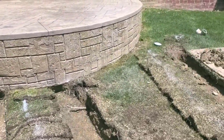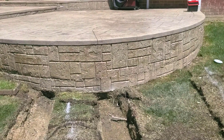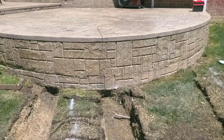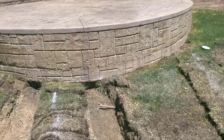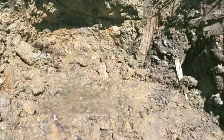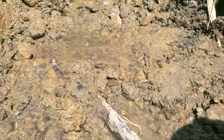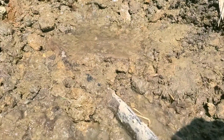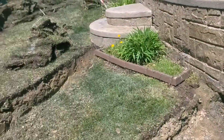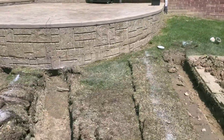When it gets inside this fill sand — or any kind of sand — sometimes the brick patio guys put too much 21AA and sand slag. You start out with something that's one-to-three inches in diameter, and look at this: the water is just oozing from this structure, the base, the foundation of the structure. I see it all the time — people are always calling me saying, 'Hey, I got a wet spot.' Where is it at? Right behind the patio.